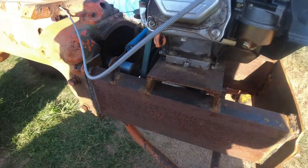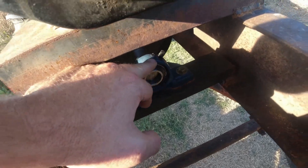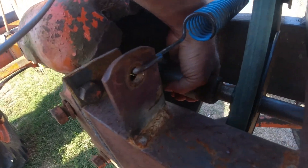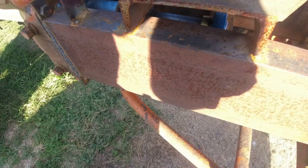What I did that I didn't like — I used what I had. I was a little bit short on my shaft, and I've only got one bearing up here, which I did with the Predator-powered F20. That actually worked out pretty good, but there's a difference. The old International stuff has almost like a U-joint — it's got a double setup with steel plates, they're on a square, offset of each other, with rubbers in between, and it allows it to flex. This does not. It's solid, and see how that's wobbling? I've got to fix this, because it's not working very good. I thought I'd get away with that, but after running a while, I can't.